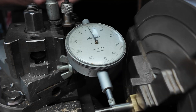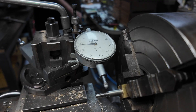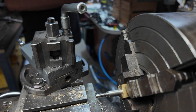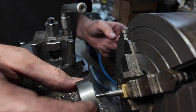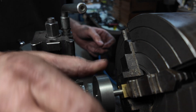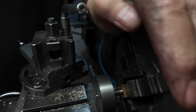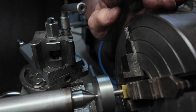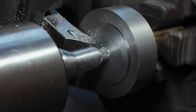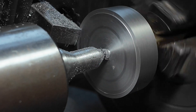Here I am re-centering the shaft with the dial gauge to make sure everything is square, because I took it out at that point. Final test of the piston — I have to really nip it up to get it over that little mating surface. It works really well. The final step is to turn it to size on the actual shaft in the lathe so it is as perfect as it can be.